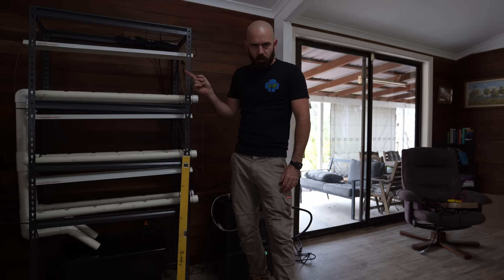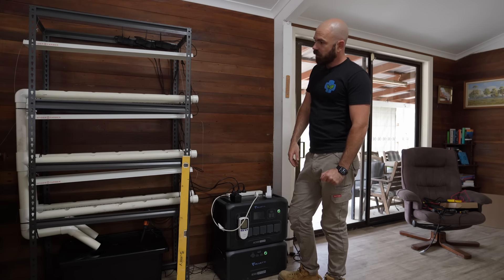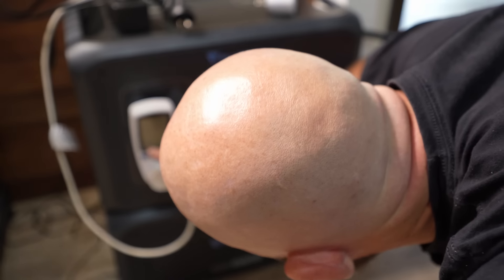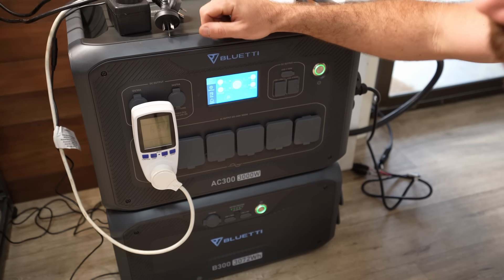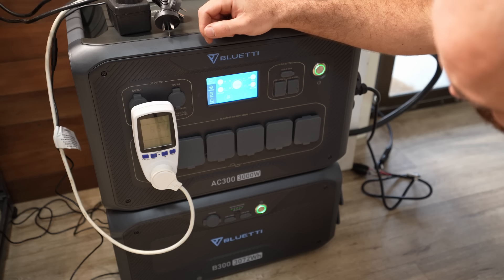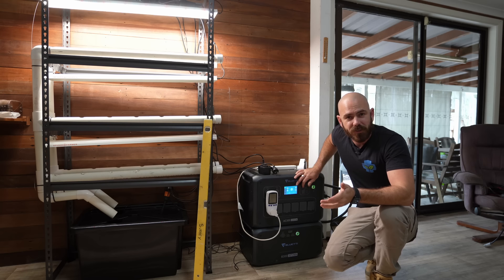However, these lights are drawing more than I expected. I'm not sure why — I think it's because they've got a high power factor. They are drawing about 375 watts between them, and they're meant to be 60 watt lights. The light is drawing 136 watts, and it's a 60 watt light — it's saying 65 watts. I have read that these lights have a high power factor, which means the reading they give is not the actual power draw once it goes through the whole system. So they may actually be 137 watt lights. Please don't ask me what power factor is — I've tried to understand it. If you do, leave a comment below because I'd love to have it explained like I'm five.